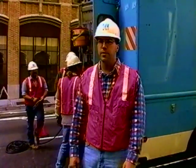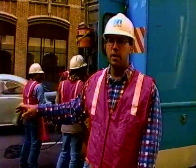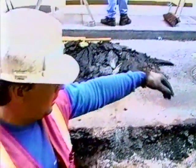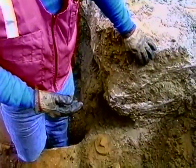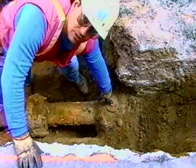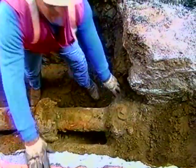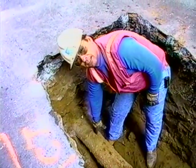Today we're going to be doing a low pressure gas cutoff on a six-inch gas main. This is where we actually were going to have a cutoff — we always try to cut off near property line. They dug down here to cut off the property. The vault was on top of the main; it was poured into the main. I'm going to utilize this hole as my bag hole — this is where I put my bag. Clean this out, drop the bags in there. Over here I'm just going to tap out a bag hole. This is for demonstration.